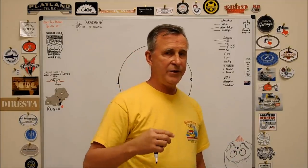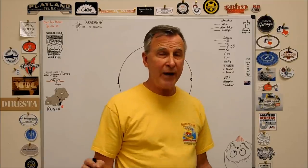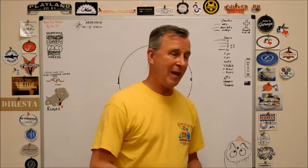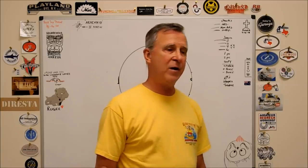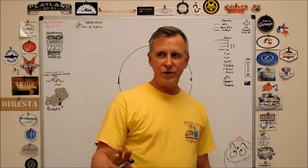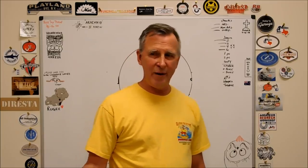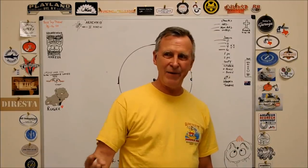use a piece of scrap metal, piece of a gauge pin. I know my guy, some foreman's throwing his clipboard against the wall, going, never use a gauge pin in a chuck. I do it, but if I'm using aluminum jaws and I have a hardened steel gauge pin in there, chances are you're not going to damage the gauge pin. I don't endorse squeezing gauges in machines because that's just not a good thing to do. But in a pinch, you know, don't like to see it done, but it'll work.